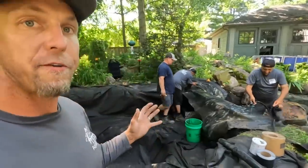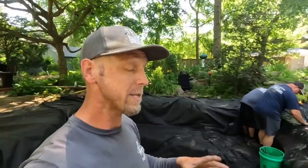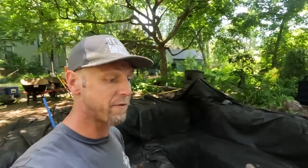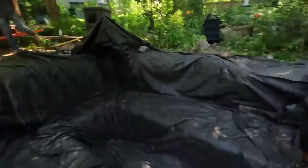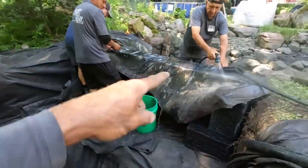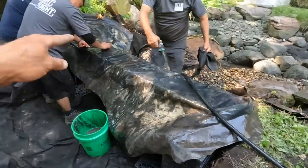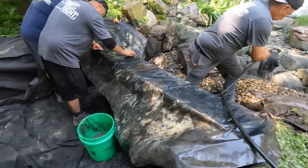So we're going to finish getting this thing prepped, dried off, primed, double-sided tape. Then we'll get the other liner in here, place it where we need it to be, prime that and attach it to the double-sided tape, and then the six inch cover tape over the top. Then we can get into the fun stuff, which is always the rocking and rolling. One challenge we always run into is getting all these wrinkles out in the liner. We've put a two by 12 board resting on top of some of these aqua blocks just to get it up to the height we need, and we pull everything out nice and straight. It's important to have a few sets of hands for this.